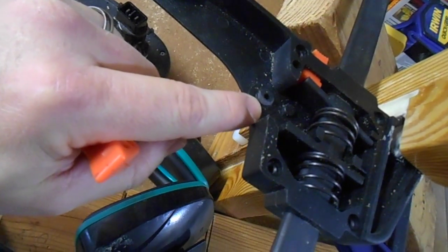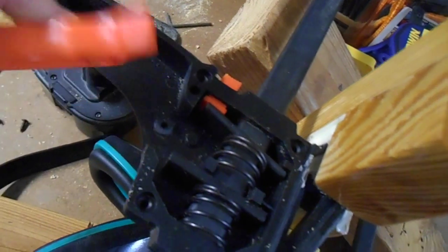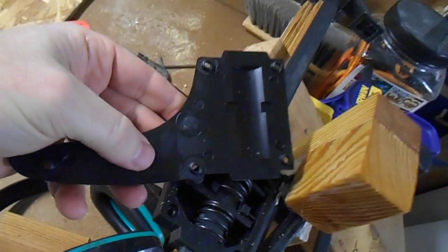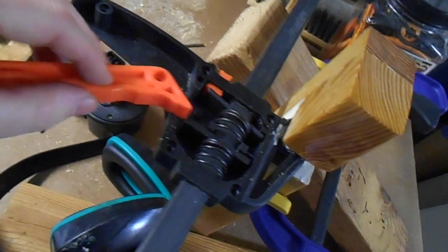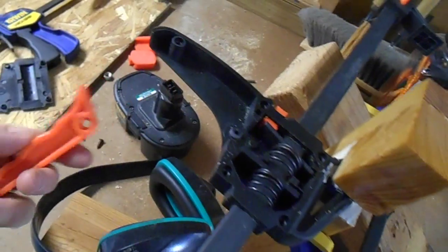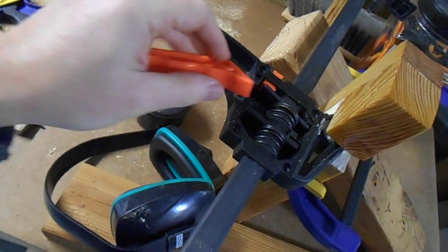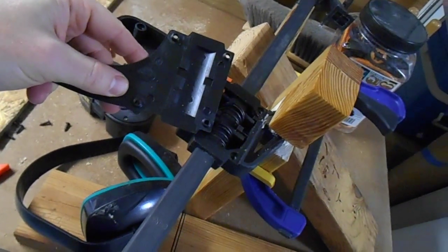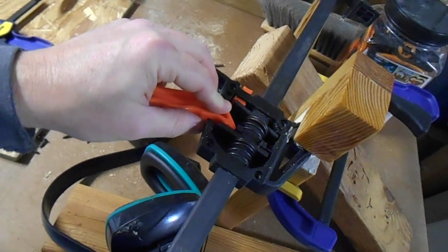I don't know if you can see the wear on that plastic edge right in front of my finger — all around that edge it's worn. There is nothing keeping the trigger in. There's a pocket that it fits in, but nothing keeping it in with that plastic tab. There's not even a matching inset on the opposite cover plate. The trigger was clearly designed and molded with two parts and is meant to have a bushing and a bearing. But being typical cheap Chinese manufacturing, they either changed the molding, didn't bother, or left pieces out. This is horrible, horrible design. I thought I might be able to reuse it, but I'm going to have to drill this out, build a proper axle, and mount it in both covers so that the trigger is actually held properly and securely and won't come loose.